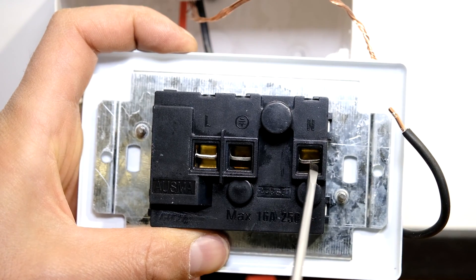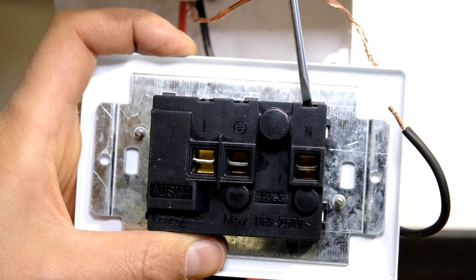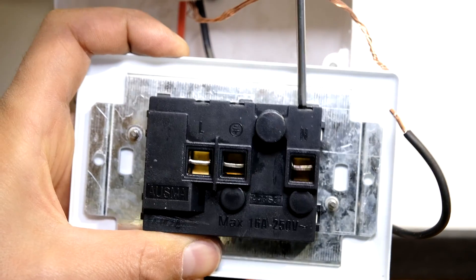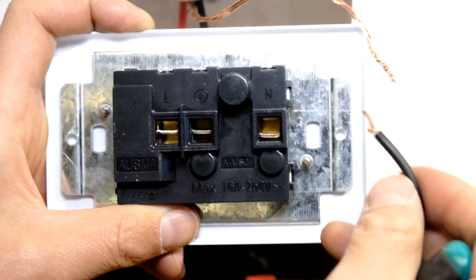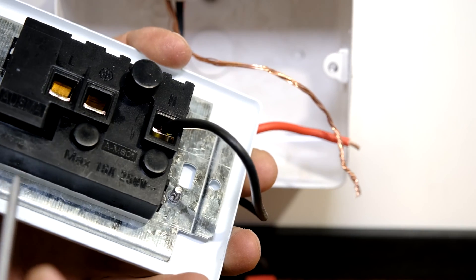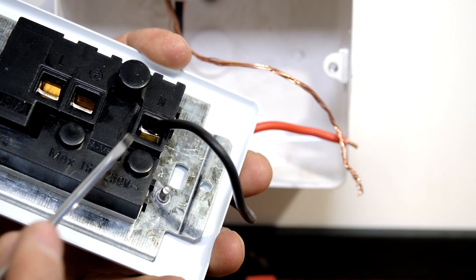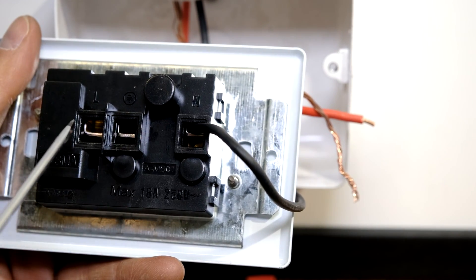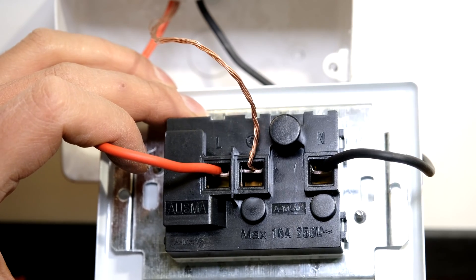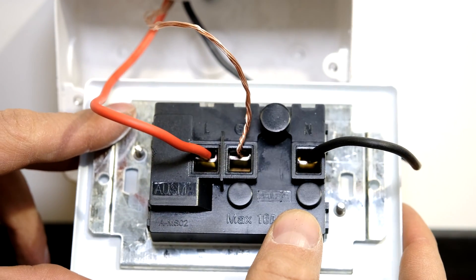Here is another one with a face plate. There's a slight difference in how the cable is tightened inside — usually it's a screw, but this one follows what we use on a circuit breaker: a moving platform that squeezes the cable. First open that platform, insert the wire, then fasten the screw. That moving plate must fasten onto the copper, not the jacket — otherwise you won't have good conductivity and it will arc. Re-tighten screws after wiring live, earth, and neutral.